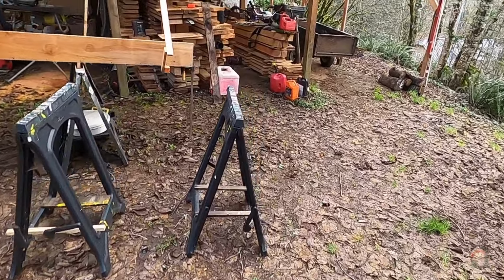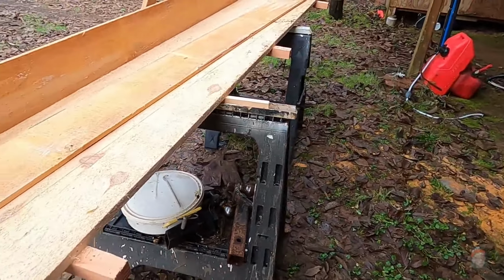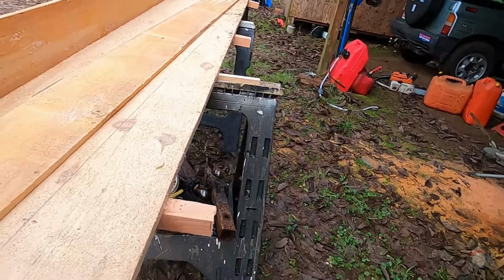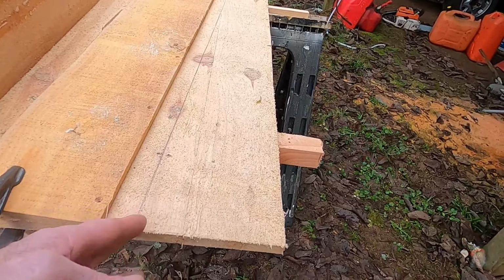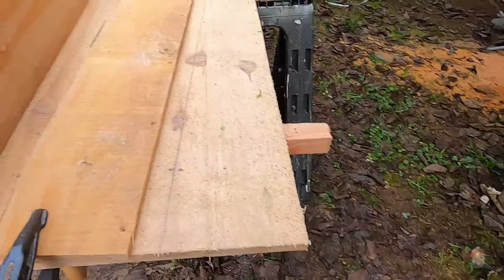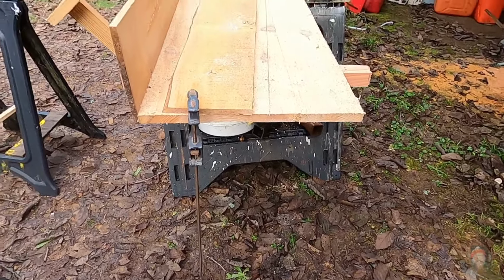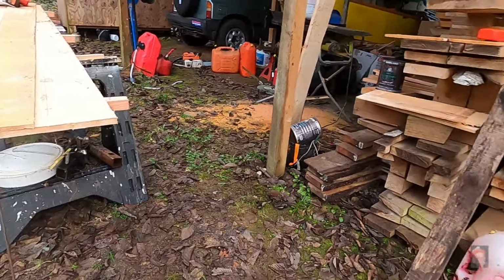What I've done with this one so far is unscrew the short verticals on this side, unscrew the sideboard using that as a saw guide. I'm going to cut this one down to this pencil line here, put the side back on, shorten the braces as needed, and I hope I can get all the succeeding flumes out of one board width.